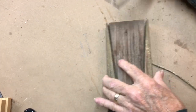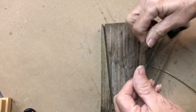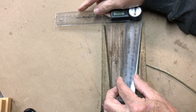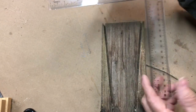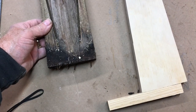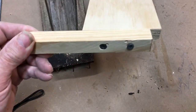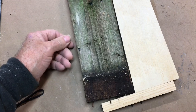I went ahead and partially disassembled this. I'll set this at zero and it looks like I've set this at 85 degrees. I honestly do not remember how I cut this groove before, but this is the way I'm going to do it today. I have a five-degree angle here from a scrap — a little piece held on here with some screws — and I will put it in here and run it through the table saw.